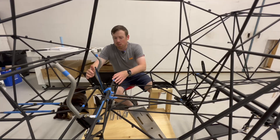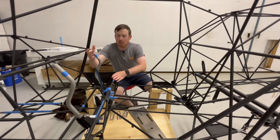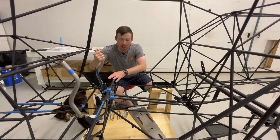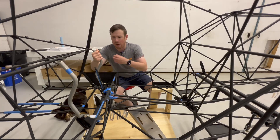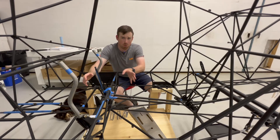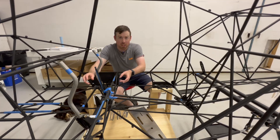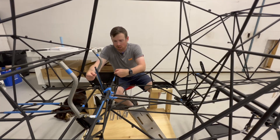The biggest issue I had was with the bearing block. When I was drilling the second hole for its mounting, the block deformed quite a bit, which meant that when everything was mounted in and torqued up correctly, it took a lot of force to move the stick fore and aft. That necessitated removing quite a lot of material out of the bearing block to get back that clearance fit with the control column. We started off hand sanding but that was getting nowhere quickly, so I invested in a drum sander bit, put that into the drill press, and was able to aggressively go at the bearing block and managed to get it opened up enough for what I think is a pretty reasonable clearance fit.